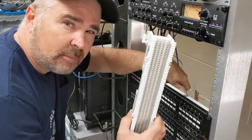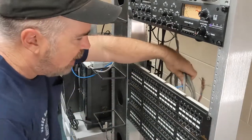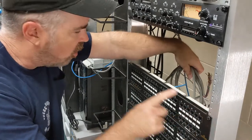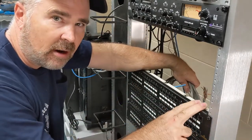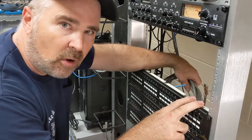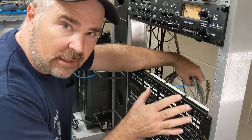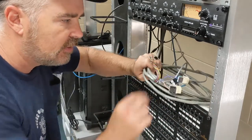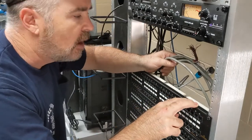The 66 block has enough spots for all 50 wires. The patch panel, however, only has 24 places where you can punch down a single pair. You could say, well, I'll just double up on one jack — but that doesn't work easily, because none of the applications of the individual pairs call for two pairs to be put on one RJ.